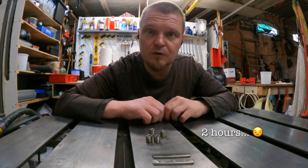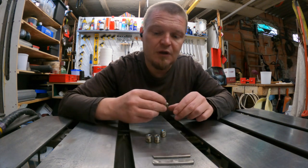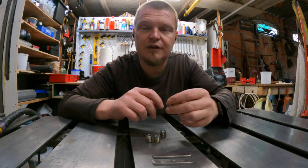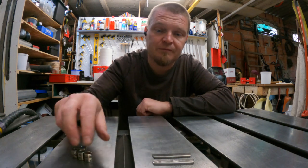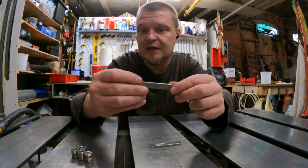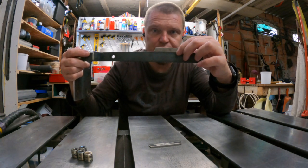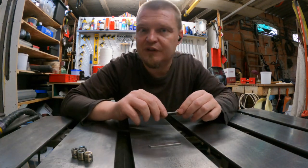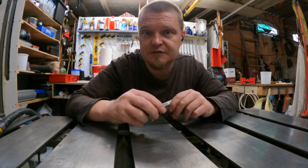Once again, I've spent way too long fiddling with some small things like these nuts. This is basically two stainless steel M8 nuts welded together and then capped with another piece of stainless steel. And there's four of them. These two pieces here are just some pieces of stainless steel. They're supposed to be the little lip that the bracket is corresponding to, and the box rests on these lips, aiding the removal and refitting of the box. Yay! Hours fiddling with nuts.